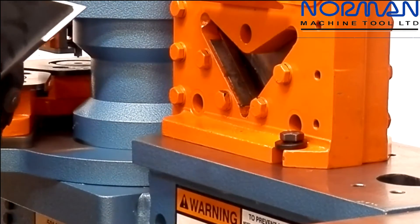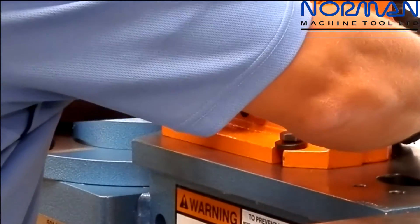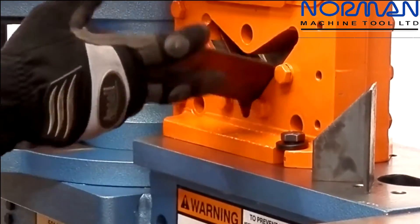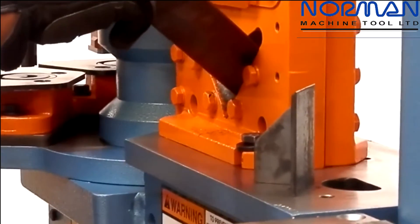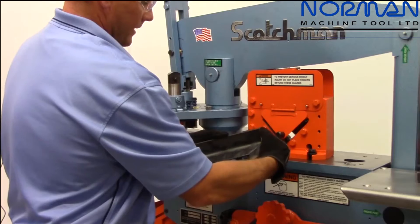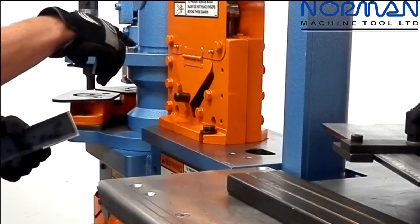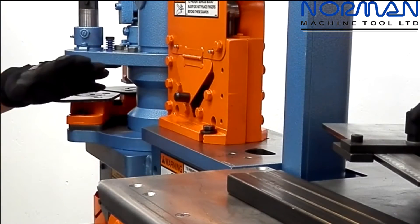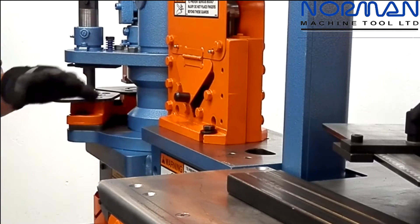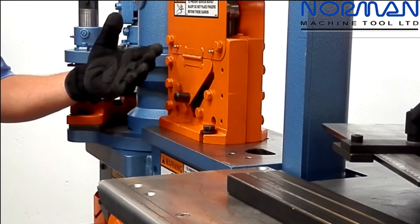You've got a 45-degree edge. This is another way to make a box frame if you don't want to use your notcher. There's the piece we cut — we'll miter the other direction. And if you're welding a frame together, that's about as pretty as it gets, as quick as it gets. Now keep in mind, this tooling area sets Scotchman apart from all the rest in the industry — we have the largest open tool cavity of any iron worker in the world. We'll come back to this area later to go over some of our optional tooling.